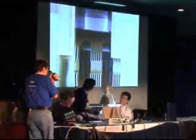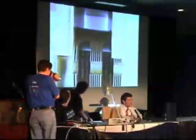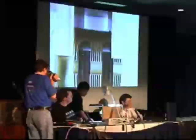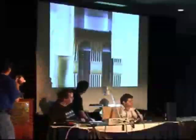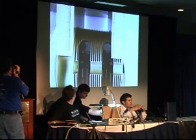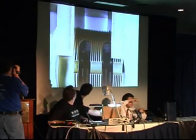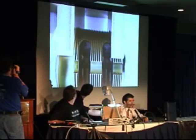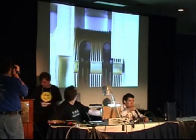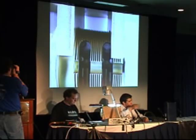This is multi-lock. Multi-lock uses a double pin or pin-in-pin system where you have an exterior pin, and if you just had exterior pins, it would be just like a normal lock. But if you took a drill straight through the inside of an exterior pin, you have an inside pin. So you have to get both of them to match. Plus, the keyway is a horizontal keyway instead of a vertical keyway. So when you take out your key, everybody gets the key stuck in the door because they're sitting there with it straight up and down and it goes sideways.